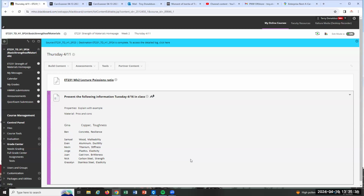Strength? There are a lot of other materials that are stronger, but it's tough because it has a high elasticity. It's bigger than most, so it has a higher elasticity before it yields. I looked up the properties, and it has a density of 550 PCF, which is pounds per cubic foot, a modulus of elasticity of 15 million PSI, and a tensile yield of 40,000 PSI before permanent deformation. The ultimate tensile strength is 55,000 PSI, and shear strength is 38,000.